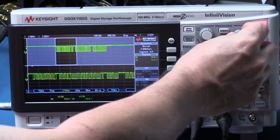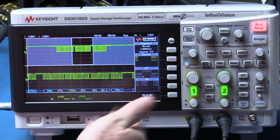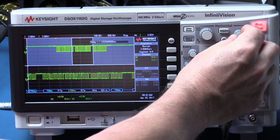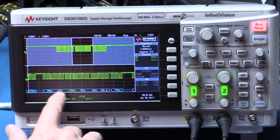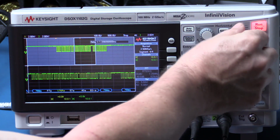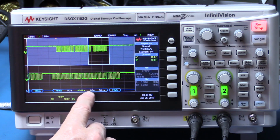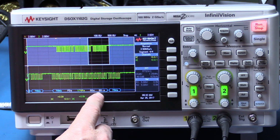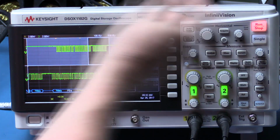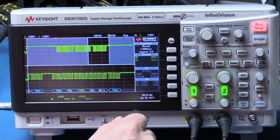We're then writing for that. So it's going to read pressure. I might get these in the wrong order, but pressure, temperature, and humidity. So that will be the second one. So writing F7, reading back 57 40 E0, and then writing 76 FD, reading back 66 B8. And then that's repeated every 3 seconds. So that's actually now nicely decoding the data.